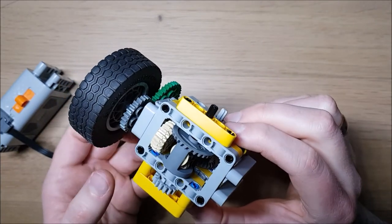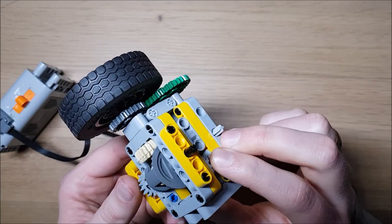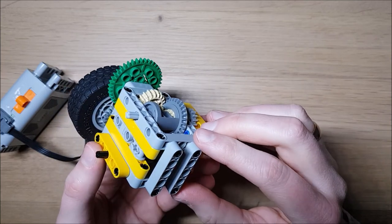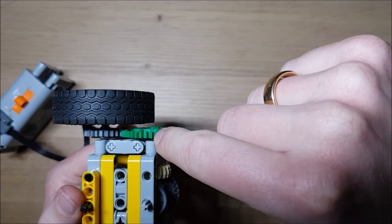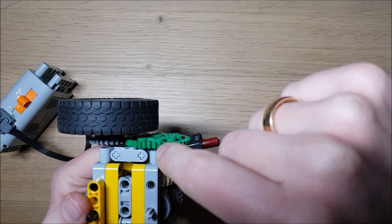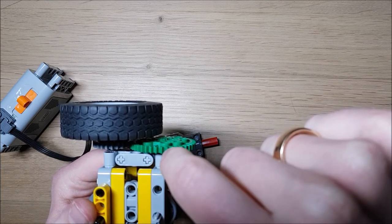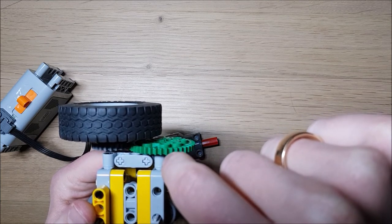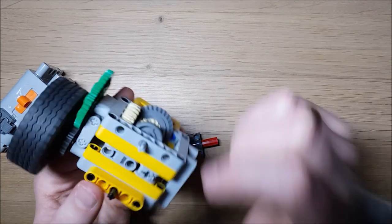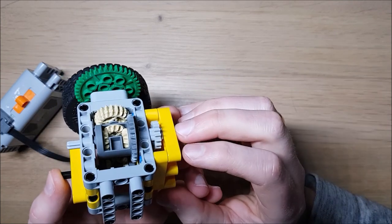With this design you have a very smooth transmission from first gear to second gear, and it's quite compact. You could also exchange this gearing ratio for another one — the constraint is just that it's five axle holes separated, so it's a little bit difficult to find appropriate gearing combinations. I hope you like it and see you next time.